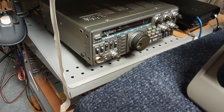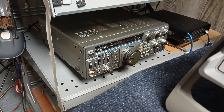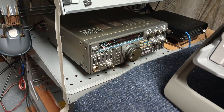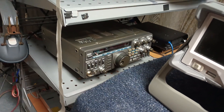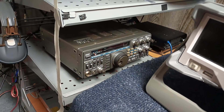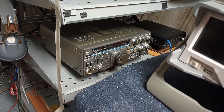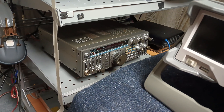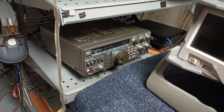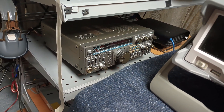So I was transmitting with the Yaesu and receiving on the restored Kenwood, and it was banging in a 60-over signal — of course the antennas are not quite touching. So an extremely strong signal in the Kenwood. And what I have never, never seen or measured before is this idea that reflected power also causes distortion. The theory is that traveling wavefronts in the coax collide and distort the signals.